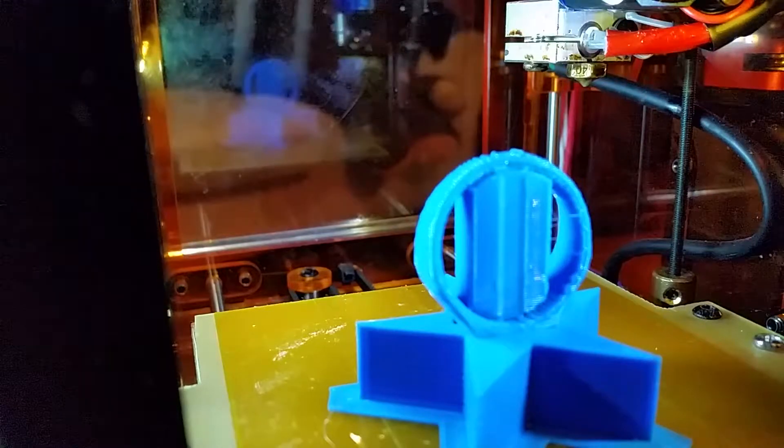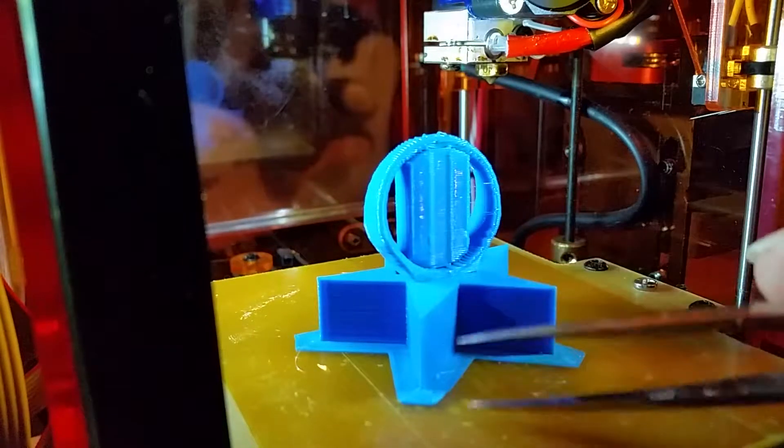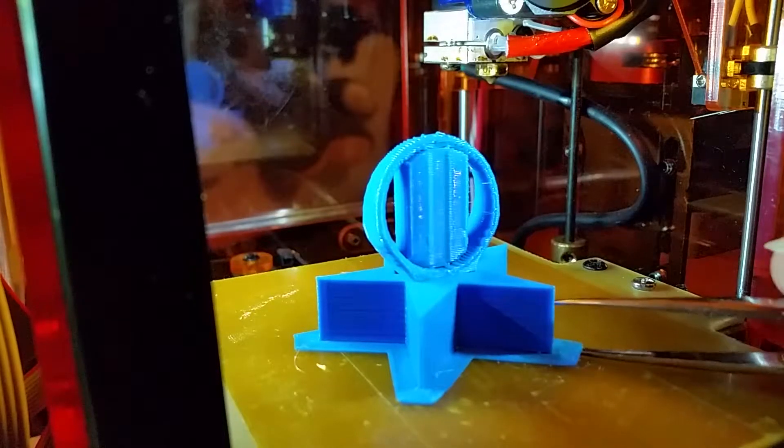One of the things — while it's pausing here — I didn't realize how long this part is. I'm just getting my steel tweezers to show how easy a thin film of glue stick on top of Kapton tape works. I just apply a bit of glue stick and then wipe it over with a wet cloth until it's evenly spread across the whole surface of the Kapton tape, which gives it a very dull, matte finish, and that's what the PLA sticks to pretty well.